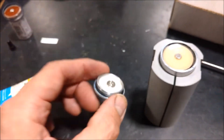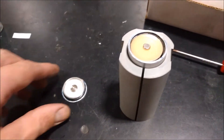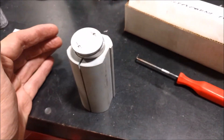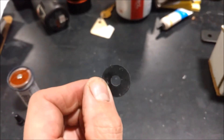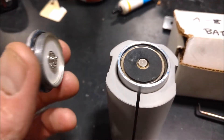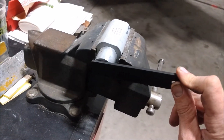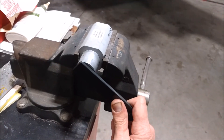I've replaced the o-ring on the cap, applied lubricant to the o-ring and to the threads on the cap and the housing, and it's just a matter of putting this all back together. I almost forgot this little rubber washer - let me take it apart, put that back in, and then tighten everything up. There it is, the rubber washer is in place. The installation instructions don't give a specific torque on this cap, so I'm just going to use some common sense and tighten it down until it feels about right.